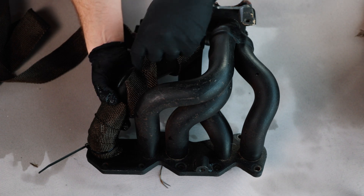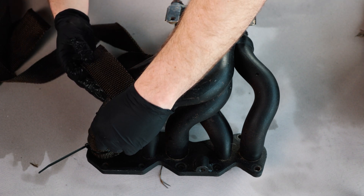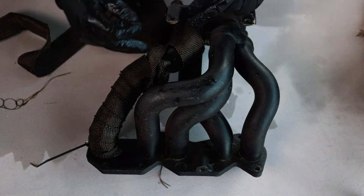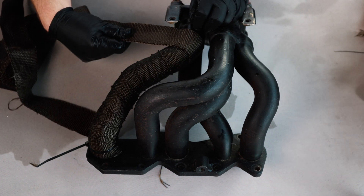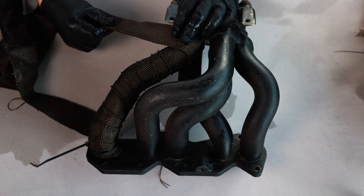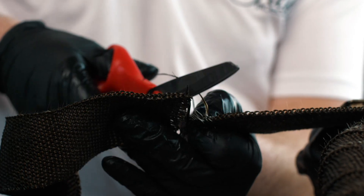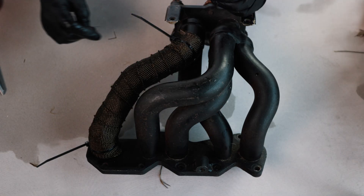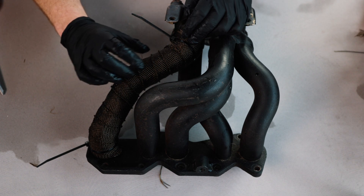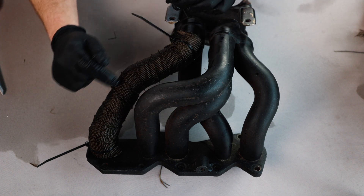It is a little bit more moldable compared to something like a gold tape, so don't be afraid to fold that over to really help get that consistent overlap. Then pull it nice and tight, cut it down, and secure it with a plastic cable tie until you come back to join the next pipe. At this stage just check your work — make sure your overlap is really consistent. It's not always possible to get a perfect overlap, but make sure it's nice and tight all the way down with no loose areas. If needed, this is a great time to undo your work and go again.